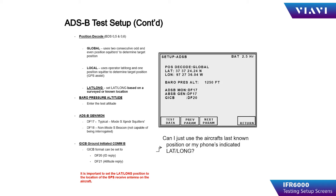Barometric pressure altitude is the test altitude that you're using on the aircraft being tested. ADS-B generate and monitor allows you to choose either DF-17 or DF-18. DF-17 being transponder-type ADS-B compliant devices, and DF-18 is simply a beacon. GICB, or ground initiated COM-B, is where the operator determines what type of interrogation is used to extract information from the UUT. For determining longitude and latitude of your test, you can use your phone or the last known aircraft position; however, these aren't the most accurate methods and can induce errors into your testing.